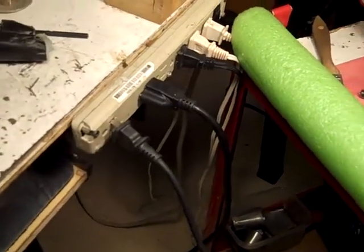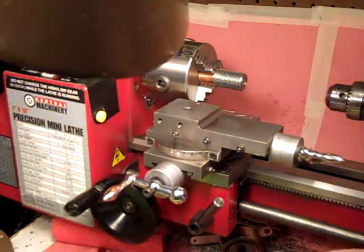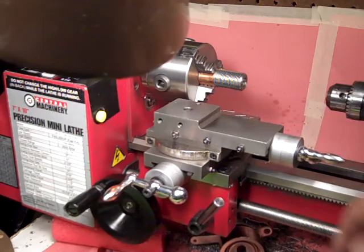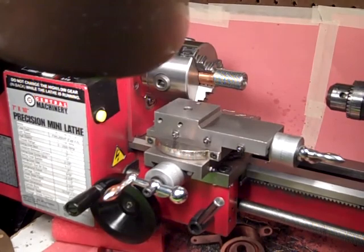And you know, you can spin stuff on a lathe and cut it with a diamond also. Like you can have something spinning in the lathe and start grinding with this to face it or whatever you want. Now you gotta be careful with that because the little particles get all over your lathe, but take this back off so your eyes don't go nuts. And that's my lathe right there. And I've done a lot of work putting the grinder up to that, and then cleaning it well after I'm done. But anyway, I just wanted to show you some of the things that I do with a Dremel that other people don't do. They're very versatile tools.